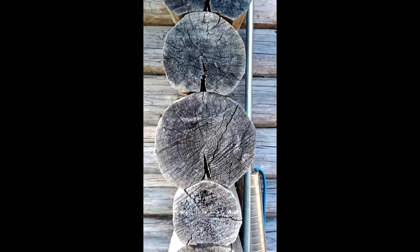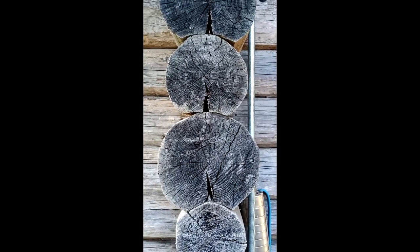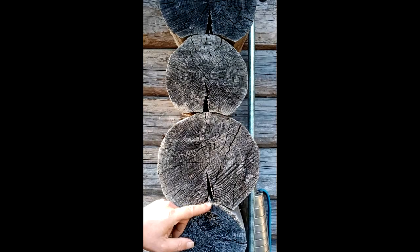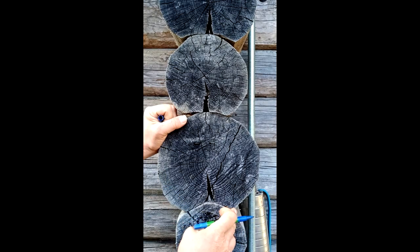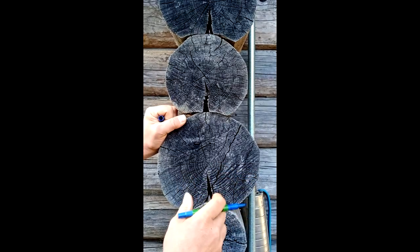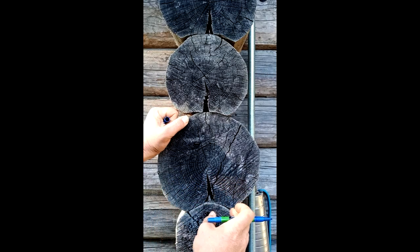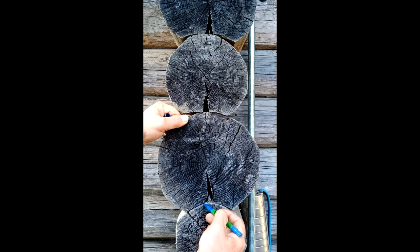And the second reason, how do I illustrate this? I've been talking about, I introduced the reciprocating saw as a way of fine tuning. And do I have a pencil here? I do. Imagine that this was a fresh log that you're putting onto the building, and you need to adjust. You cannot get a reciprocating saw to go in here.